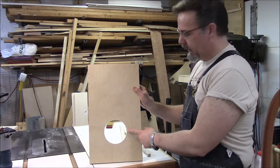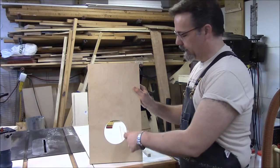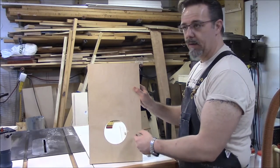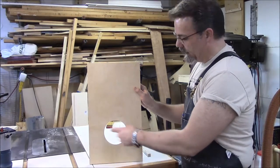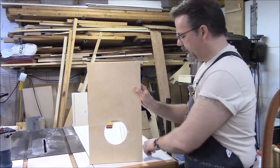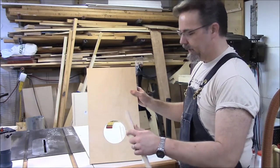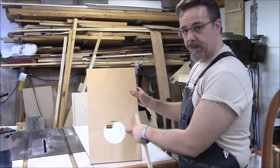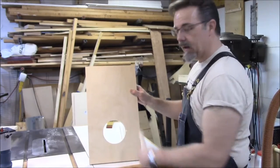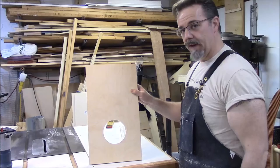So that was a rookie mistake. I felt the router bit pop through and I should have taken it off then and gotten a flush-cutting trim bit to finish out the inside. Instead, I just went ahead and did it anyway because I didn't think I was already through yet, even though it felt like it. So when the disc came loose, it moved and that's how I routed out a little bit — only about a quarter of an inch deep. What I'm going to do is cut a piece of this wood a quarter of an inch thick, fit it in there and glue it in. Then I'll take a flush-cut trim bit like I should have done in the first place, finish it off, and do a round-over so it looks nice from the outside. Stuff happens — gotta deal with it.